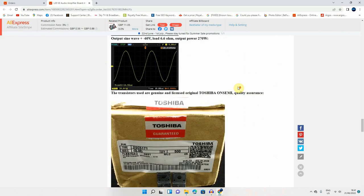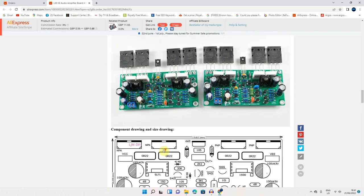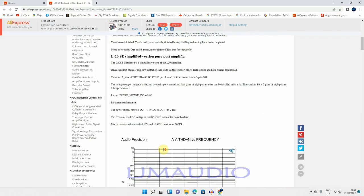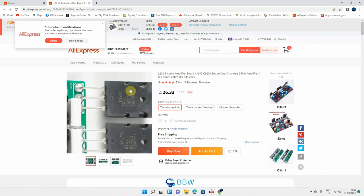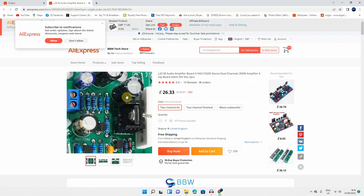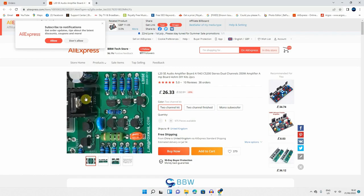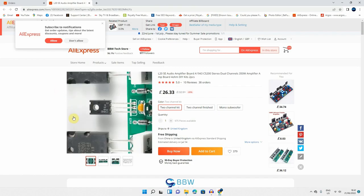That's how I'm gonna use that transformer — I'll remove a few winding turns to get down to dual 65V DC, because right now I'm getting dual 80V DC from it. The square wave and sine wave on the datasheet look good. Stay tuned, subscribe, and activate the notification bell so you don't miss the test build. Link in the description below if you're interested.